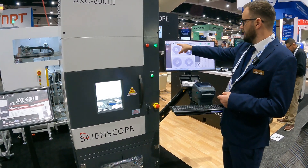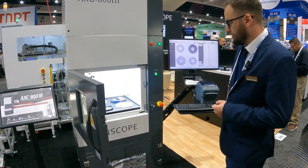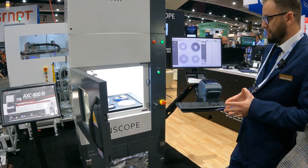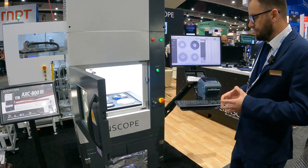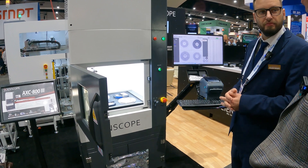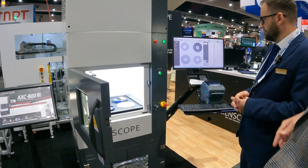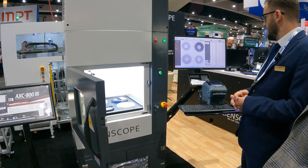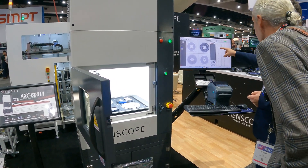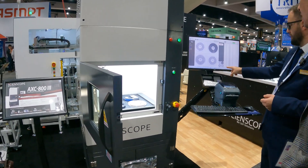Once it finishes, it found four small reels inside. We don't have any labels printed yet. We try to make our systems as poka-yoke as possible, eliminating the possibility of the operator misplacing a label. As for accuracy — 99.9%. If you run the same reels again you get exactly the same numbers, as you can see in the records: 2002, 2002, 2002, 2002 — you can run them as many times as you want.